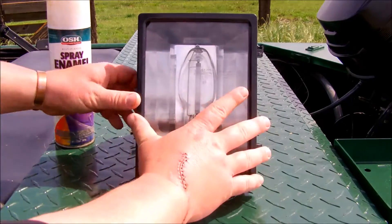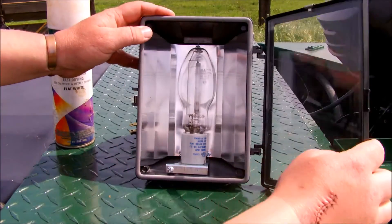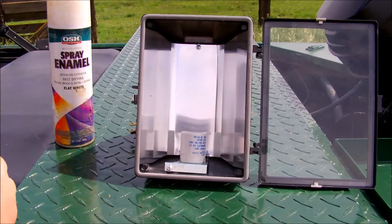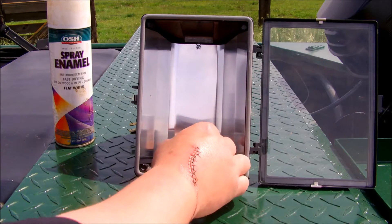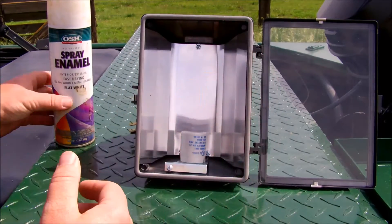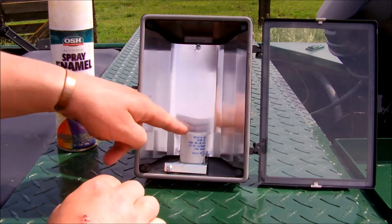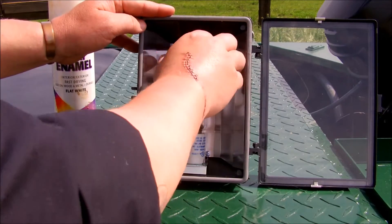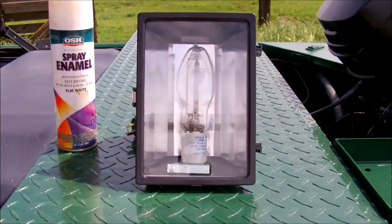If you are smart enough to be able to install these on your boat, you probably don't need any instructions on how to paint your reflectors, but I'll do it anyway. Remove the bulb, remove the screw that holds in the ceramic — whatever it's called — that the bulb screws into, and then you'll find a handful of screws in the reflector. Pull those screws out, remove the reflector, paint it flat white, reinstall the reflector, put the screws back in, reinstall the little ceramic part, put the screw in there, screw your bulb back in, and there you have it. Nothing to it.